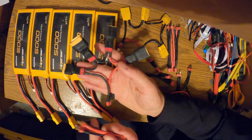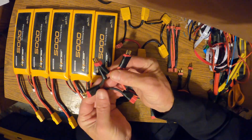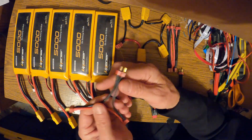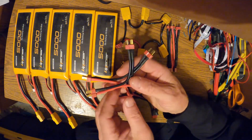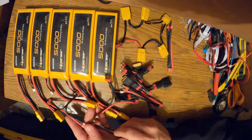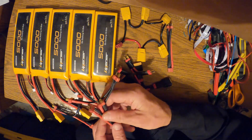I've done that with all my toys — I've been running these for a long time. You could do three cells for a 36-volt system, or two cells for a 24-volt system, like some of the power wheels my little kids ride. If I want to ride for a long time, I parallel them and boom — you've got 10 amp hours at 24 volts and you could drive that power wheel for hours.